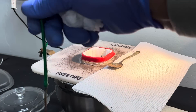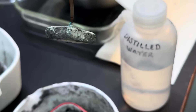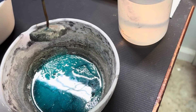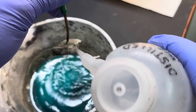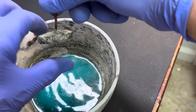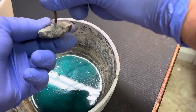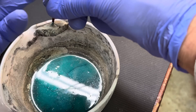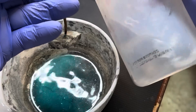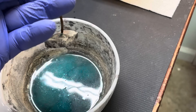This anode bar has got a bunch of gunk on it — can you see that? So what I'm going to do is try to rinse a little bit of this off with some distilled water, just kind of loosen it up by rubbing it with my hand, clean that off the bottom of this, because it will interfere with the flow of current through the silver cell. That should do better for us.